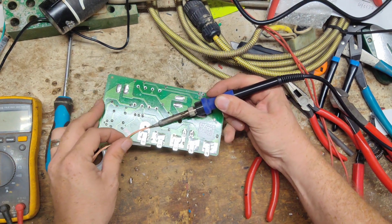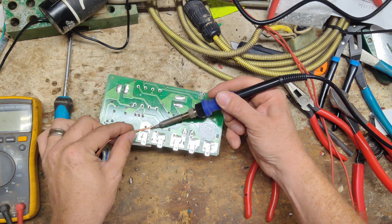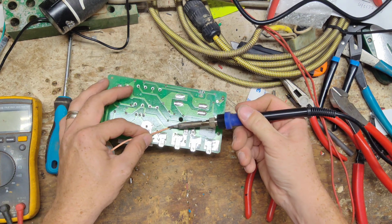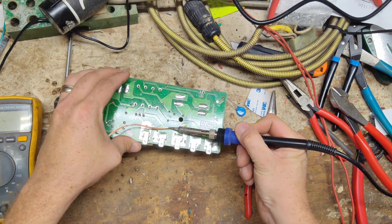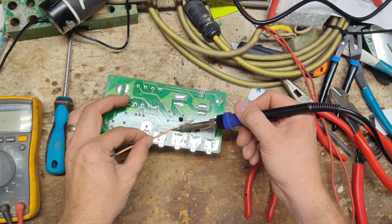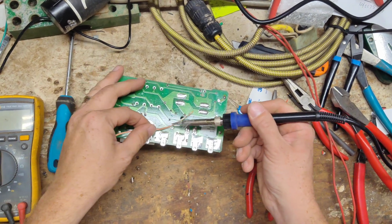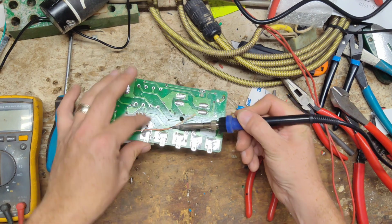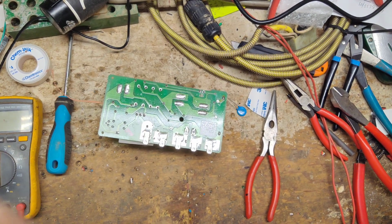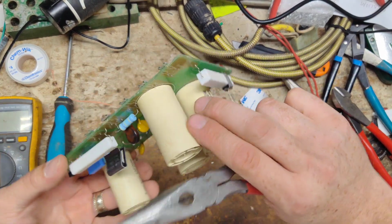Now the reason why those things went bad is typically a power surge on the AC side. That's what those things are there to help out with. Occasionally we'll see where we fix one of these boards, send it back, and a week later it burns out that part again. And it's like, no storms were in the area. Then you find out that the guy's ground rod was attached to some other ground system or something, and it just caused a chain reaction problem of some sort.